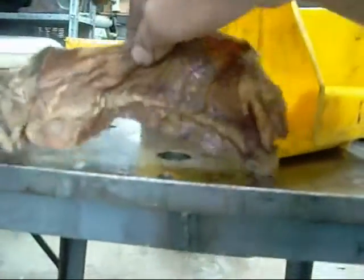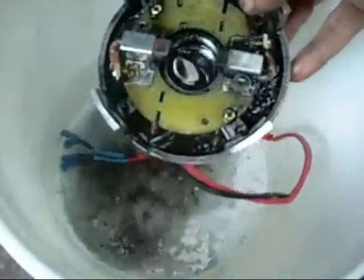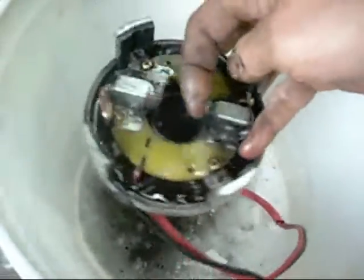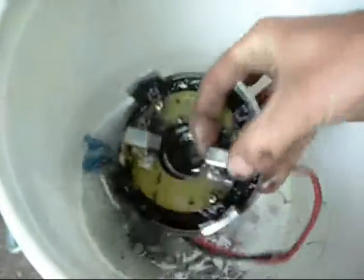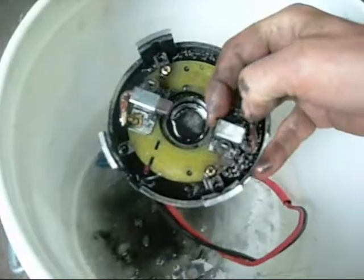The worst problem was this lagging tape, which is coated in a silicone grease or something for waterproofing. That greasy crap migrated into the back end of the housing and into the brush gear, causing one of the brushes to stick back — it was just stuck open, so there was no current getting to the commutator.